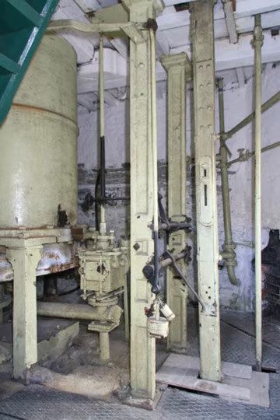The term cataract became a synonym for dashpot, at least where this was associated with steam engines and their governors. They were used as a damping device to avoid over-sensitivity with centrifugal governors. Cataracts were also used as an over-speed safety device for direct-acting water pumps. A seesaw or differential lever was placed between the pump's piston rod and a cataract adjusted for the pump's normal working speed. If the pump suddenly accelerated, owing to the pump bursting or similar, the piston would overtake the cataract and the action of the differential lever would then close the pump's steam inlet valve and stop the pump, limiting possible damage.